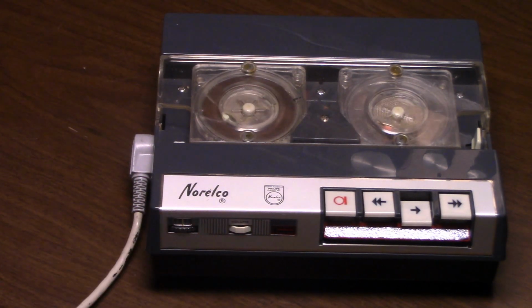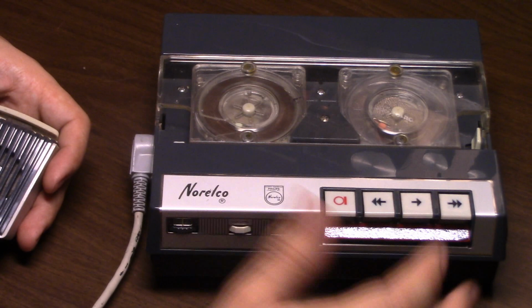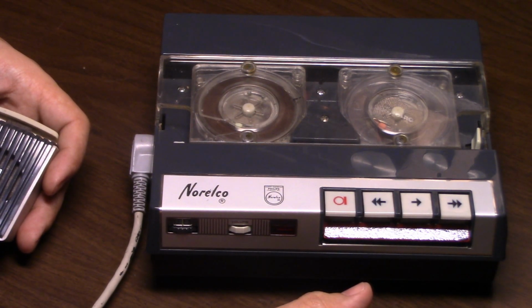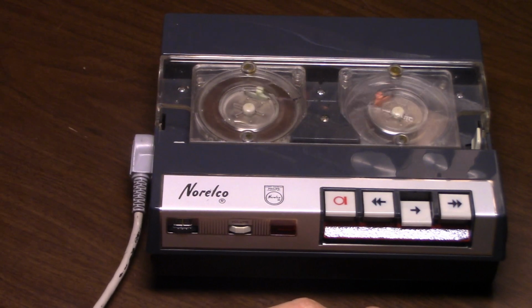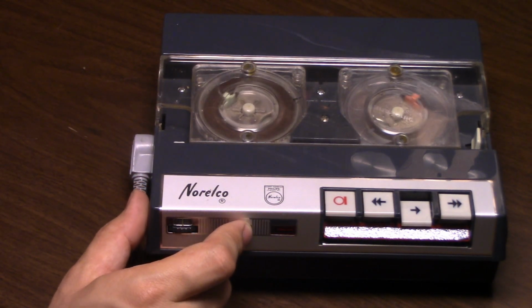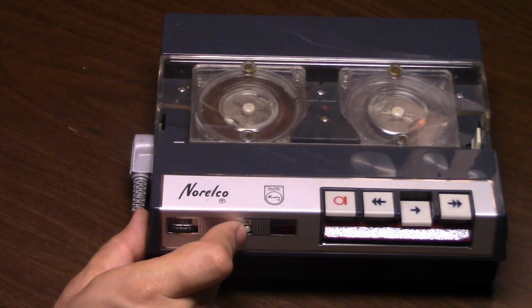This machine was given to me by a YouTuber named Jeff Bambrough, with the idea that I would transfer some old tapes to digital for him. So I digitized some old recordings, and I'm very pleased with the recorder. I replaced the AC-128 power output transistors with some vintage Texas Instrument transistors, because we were having the distortion problem caused by the power output transistors.